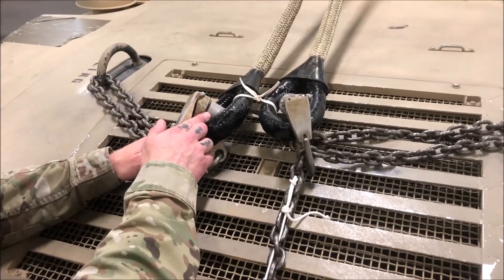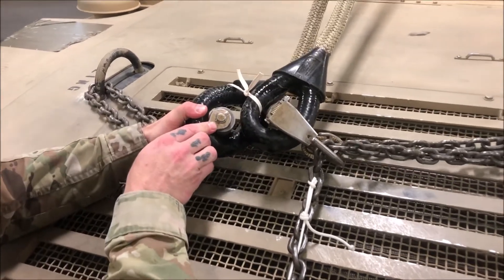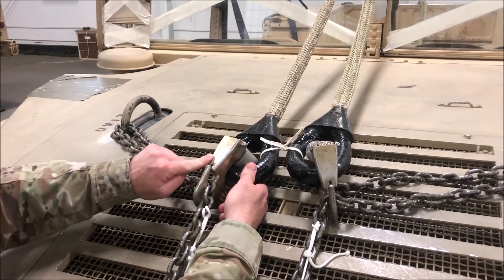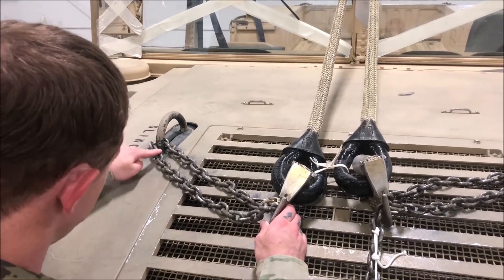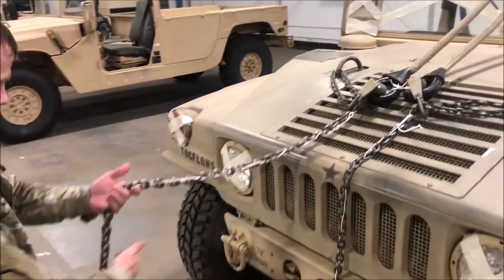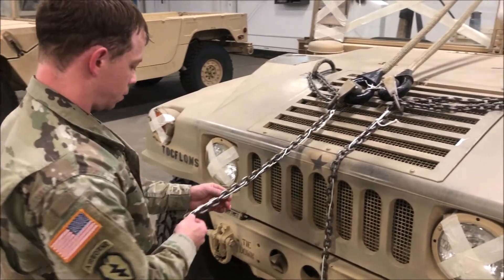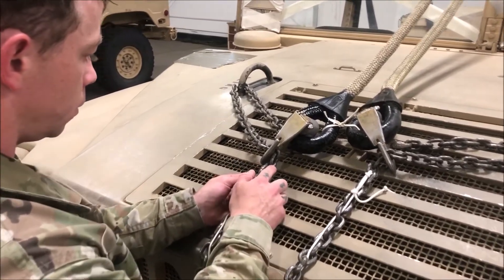Ensure that the spacer is positioned in the sling eye and secured with a pin and snap ring. This will verify that the grab hook is not inverted. Ensure that a dome or self-locking nut is present and that the keeper has proper spring tension. Check the routing of the chain and verify that it is routed one time and one time only through the lifting provision and secured in the grab hook. Next, verify a link count of 74 on the front end for the 1097 Humvee single point configuration. With 10 or more links of excess chain, notice the type 3 nylon routed through the links in order for them to be tied and taped before sling load operations.